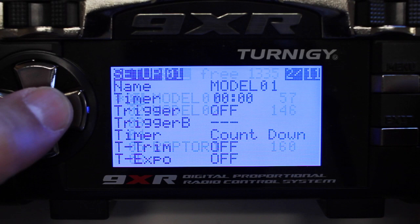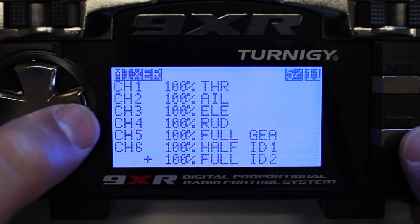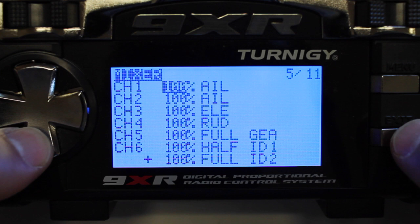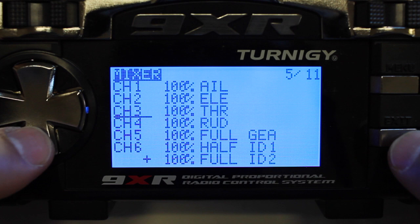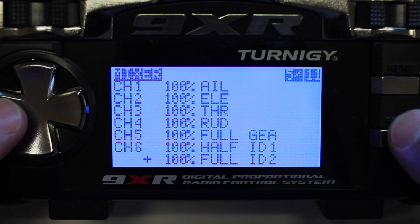Let's go ahead and set these channels up. You could just go and reconnect your leads to be throttle, aileron, elevator, and rudder coming out of your receiver, but I figured it'd be easier to just do it in software. So we're going to go into channel one, press and hold menu, change that to aileron, and hit exit. Then go down, hit menu again, change this to elevator, and exit. Change channel three to throttle, hit exit, and then we have rudder. That's AETR going into the Naza. Hit exit, go back to the menu, exit again.